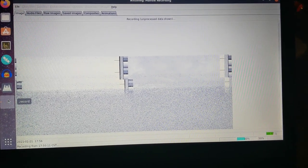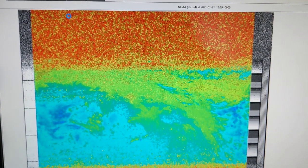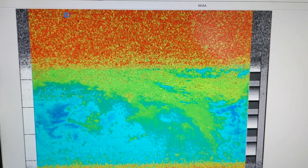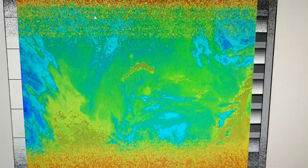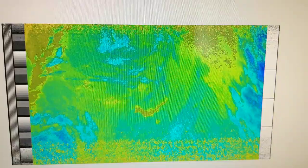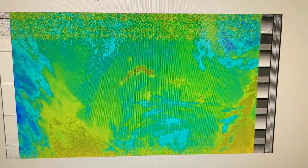It's jumping a little bit because I was moving the frequency center around to account for the Doppler shift. Here's the image I just recorded using the QFH antenna — this is an infrared image because it's nighttime, and that's the mode the satellites transmit. And here's a similar infrared image from a few days ago using the V-dipole antenna. It looks really similar, but the image is larger, meaning I got a little more usable data out of that pass, and these are both very similar passes where the satellite was going almost directly overhead. I have to say, I'm not terribly impressed with this QFH antenna. It really doesn't seem to work any better than the V-dipole I was using before. I don't know if that's because I did it wrong or it's positioned wrong, but it just doesn't seem to be worth the effort to construct it.